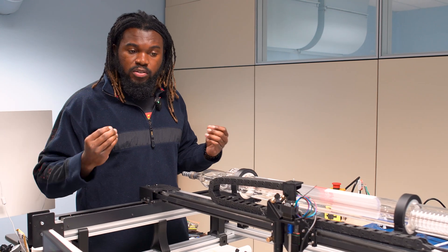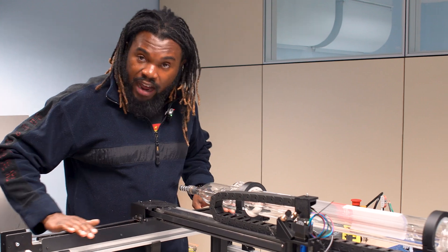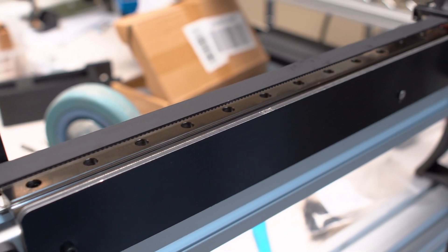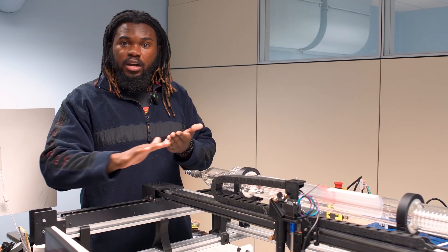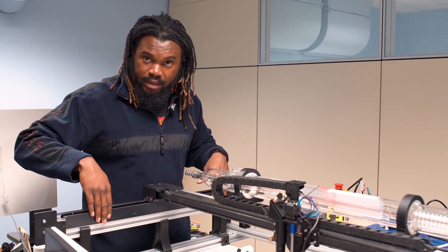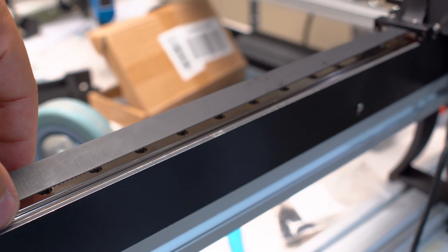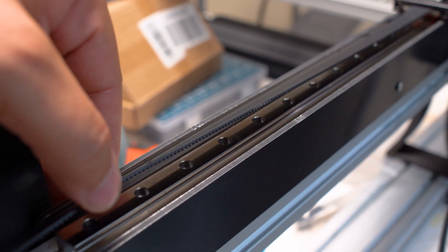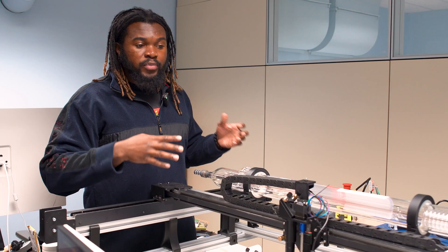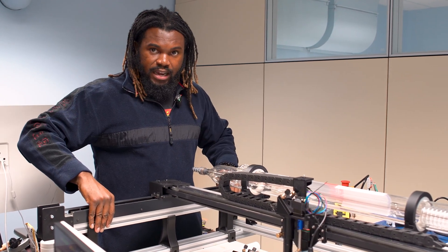It's a pretty basic design, but I really like it because I think it looks really nice. It's a cool way to encapsulate the belt drive system with this cover. You see these belt covers on really high-end CO2 lasers, but just like our AltMill, we have stainless steel covers, and this uses aluminum ACM to cover things up. When this thing is running and full of smoke, it's not messing up your linear guides or making them dirty, allowing you to go longer without having to clean and wipe things down. I like the way it frames everything in terms of the axes.